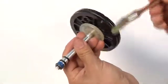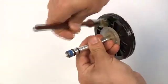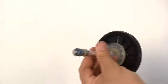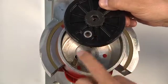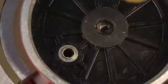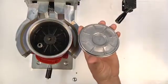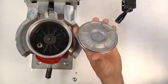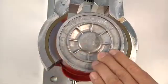Apply Panel special grease 2 to the pneumatic piston, the external and internal O-ring gasket, and to the gasket kit assembled on the shaft. Use a hammer with a rubber end to place the pneumatic piston inside the riveting tool body. Apply Panel special grease 2 to the bottom plate O-ring gasket, and place it inside the pneumatic cylinder, using a hammer with a rubber end.